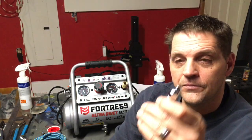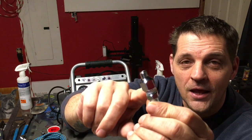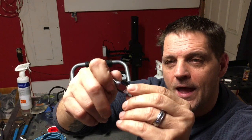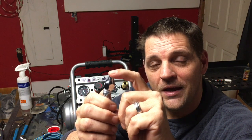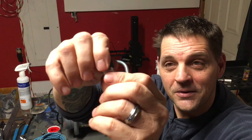Once you have your compressor adapter to quarter-inch NPT, you then need a female quarter-inch NPT adapter to your airbrush hose, which is one-eighth inch BSP threads. I'll leave a link below for a hose that comes with this adapter. If you just need the adapter, it is BSP by quarter-inch NPT — put some Teflon tape on the threads and screw them together.